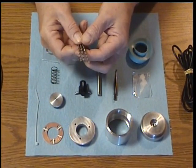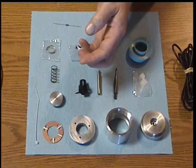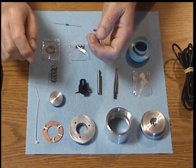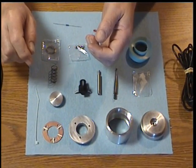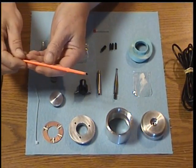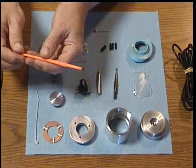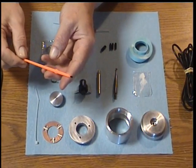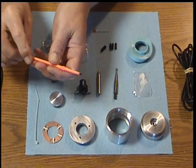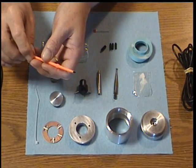The number thirty-five drill is the pilot drill for these holes. You need something to apply the flux — I use a children's watercolor brush and I cut the bristles very short, leaving only about one-eighth of an inch of the bristles. You can use a toothpick or any suitable tool to apply the flux.